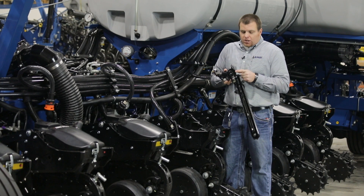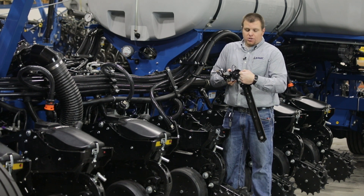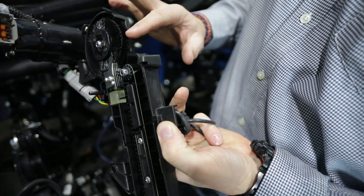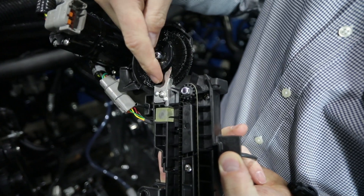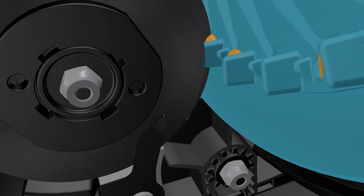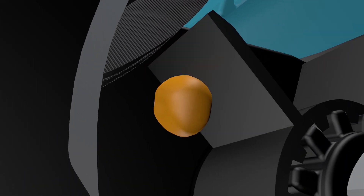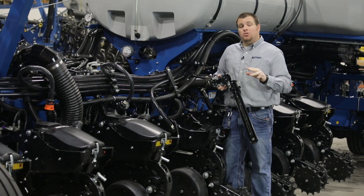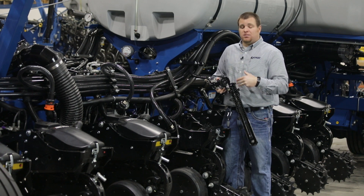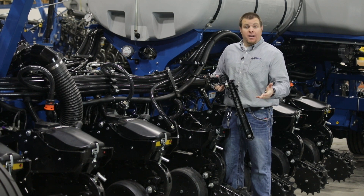If you look close, it's a two-step or two-stage brush wheel. You have longer bristles here and shorter bristles over here. As that seed's coming around on that disc and in those paddles, the taller longer brush acts like a wall and our shorter brush acts as the wiper. So seed comes around, it engages the taller bristles, and the short ones gently wipe it off the disc into the delivery tube. The nice part about this design is the seed is always in control no matter what position it's in once it leaves the disc. This keeps consistent spacing and accuracy no matter your travel speed — anywhere from 3 to 12 miles per hour.